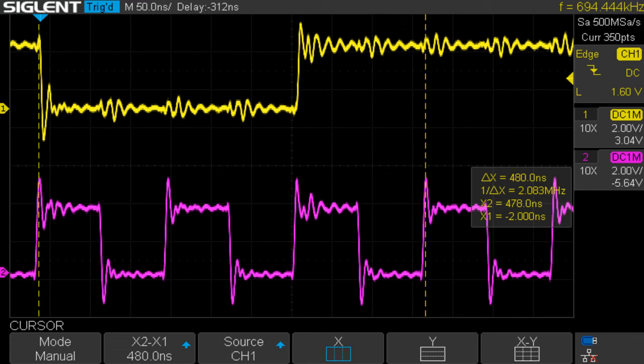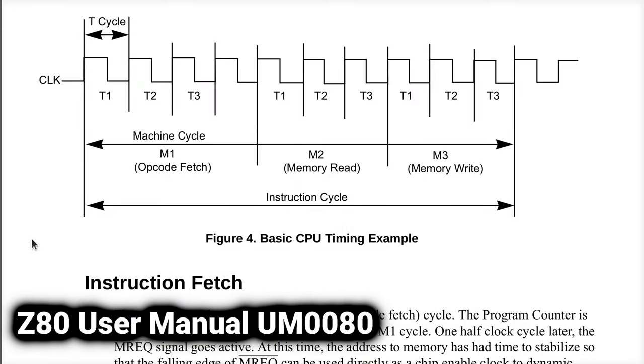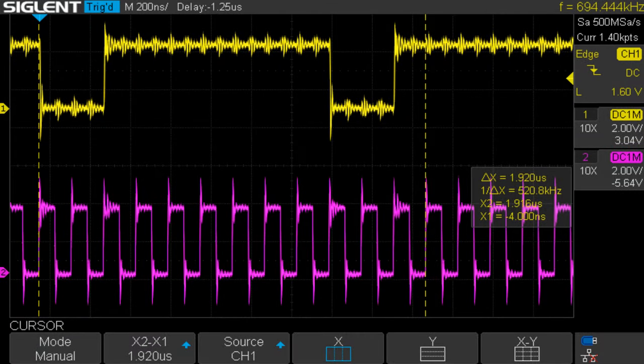So the next M1 cycle, if I zoom the scope way out, let's see here. We now see two M1 cycles on the scope, and if you count out the clocks, we're going to see 3, 6, 9 to handle the jump instruction and then go on to the next one. M1 goes low, and we see 3 clocks for each one of the bus cycles that it's using to read the values out of memory. If you remember back to the Z80 retro series of videos I did, and we looked at the timing diagrams over there, I believe the opcode fetch took place over 4 or 5 clock cycles. This goes all the way down to 3. So we're already going way faster, even with the same clock frequency to run the chip. And of course, this chip can go at least twice as fast as our Z80 did on the retro board.